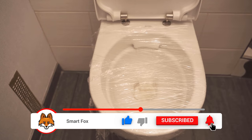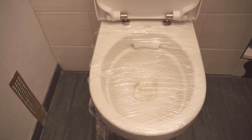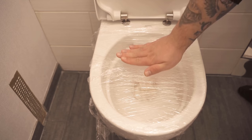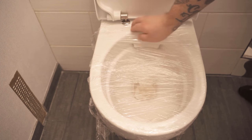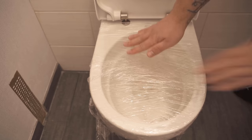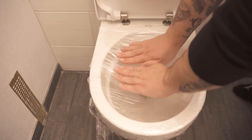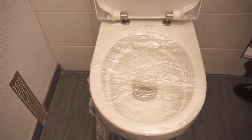I have now wrapped several layers around. When we rinse, some pressure is generated here and the cling film will also come up. Then we have to press firmly on the film with both hands and can thus ensure that some more pressure comes down. I now flush and press down hard. By doing that we should get a clog unclogged in most cases, because then we just have enough pressure to be able to push it away downwards.